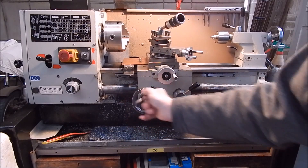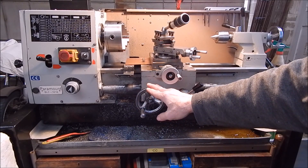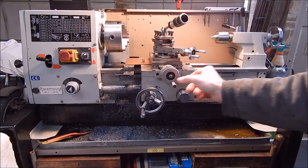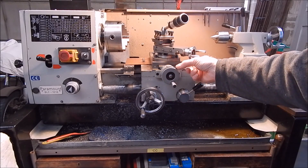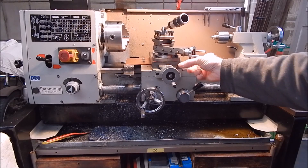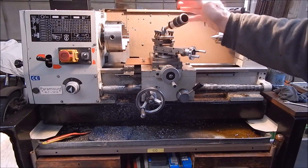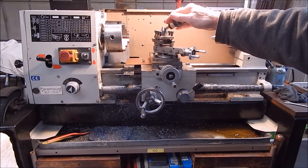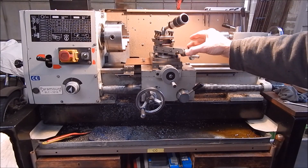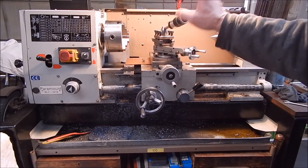They should all come with a carriage stop — it's essential. The other good modification you can do to your cheap Chinese lathe is put a cross slide lock on it, so you can lock the cross slide in a set position. That's very useful — it stops any end float or run-out you could get doing light work, particularly in milling on the lathe. Once again, you don't get that standard. In my other videos there's one showing how to easily put a cross slide lock on your lathe.